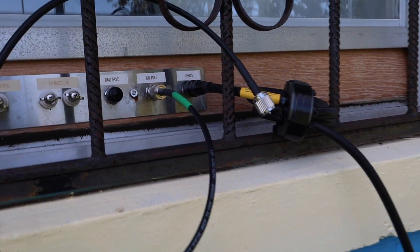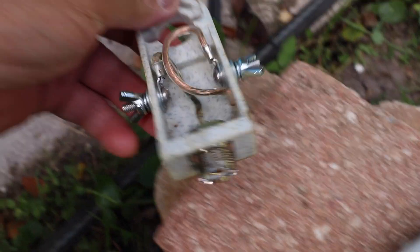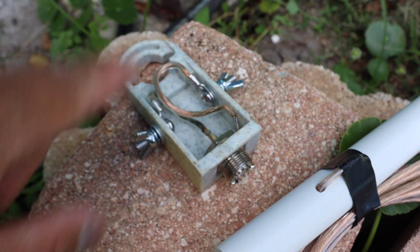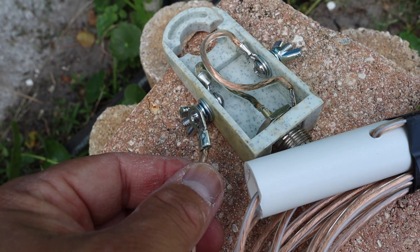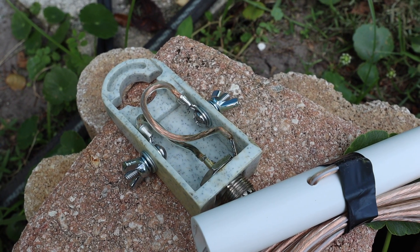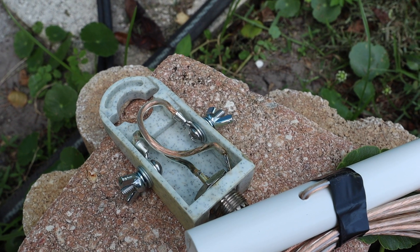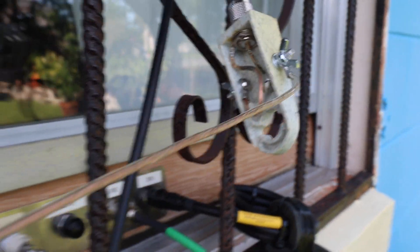This is how I want to connect my sensing antenna. I'm going to use my pass-through connection on this jumper cable and connect it to the feed point for my dipole. If you look closely, the center conductor is on this side. I'm going to take half of my dipole and just use that, connecting only the center conductor. I'm not going to worry about the ground side because all I want the sensing antenna to do is pick up power line noise or any kind of interference, so I can phase it out and cancel it using the QRM Eliminator.